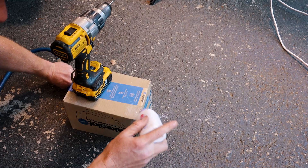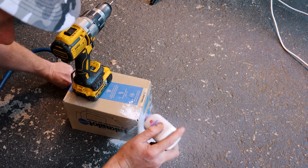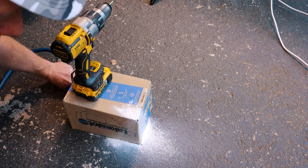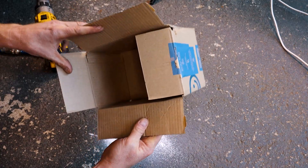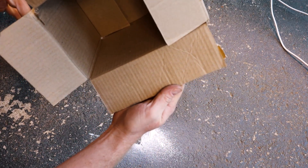Now let me try and get some baby powder right in that 5mm hole we forgot about and see what happens. Because air was on its way out, there is no way that any baby powder could move past the air to get inside. See when I flipped this box open, not a single speck of powder made it inside. You don't need a lot of pressure, you just need air flowing to the outside constantly through any openings that it may find.